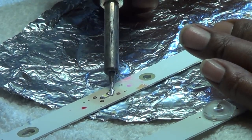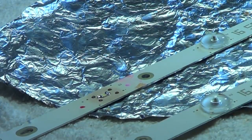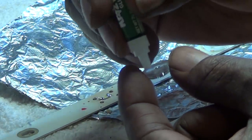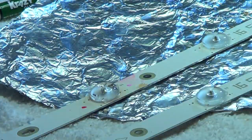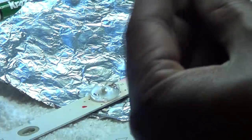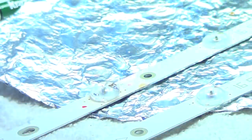I'm going to double-check it. Like I said, I can check it at the test points, and I just checked it right there. As far as my diffuser lens, I'm actually going to put a small drop of super glue on each of the little studs that are sticking up - those are the previous studs that were glued down before, and that's all I need. There are actually four studs on this LED and I'm going to try to place it directly center so the exact center of the LED is directly over the LED light - the yellow lens part. You don't have to mash it down - if you got some pretty good glue, just place it on there and don't touch it, wait a couple minutes and it should dry.